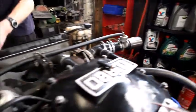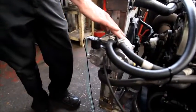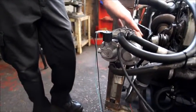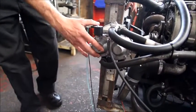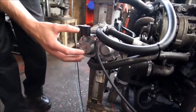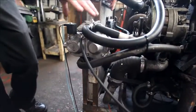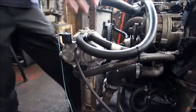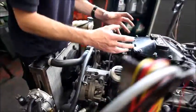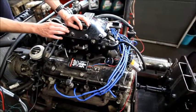Moving over, we have the vaporizer. The vaporizer is a dual-stage vaporizer we use in all of our LPG draw-through systems on early carbureted engines and quite a few fuel-injected ones as well. The R90 vaporizer is dual stage, so we've got a small section at the front for fueling the engine at lower RPM and the larger section on the rear - which we'll hardly use on this one - for higher RPM. We have to set the RPM to 1500, as 1500 RPM gives us 50 Hz.